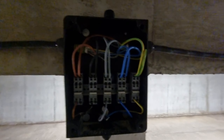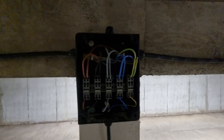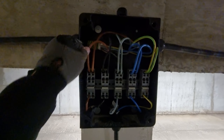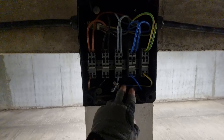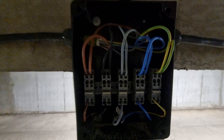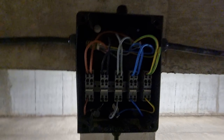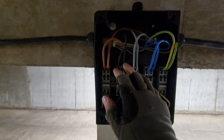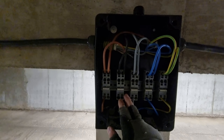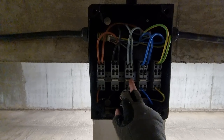Here's one of the boxes with the wago DIN rail stuff in. I'd normally want that looking a bit neater but these are 10mm solid-core high-tuff, so they're not the easiest to work with. We've got 6mm coming down to the charger — the 10mm is going all the way down and that's due to voltage drop on the circuit. We've probably got 25 of those to do. We've got the little jumper pins to link two together — not just because it's three-phase, but because in some of them we've got more than three cables. The jumper lets you do six instead of three.